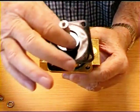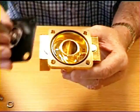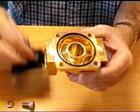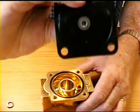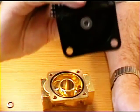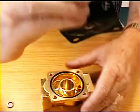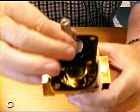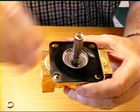So if this seal is over the top and it's pressed down lightly it can't open, and what happens is that the media will actually come through a very very small hole in the diaphragm. It's important that that hole is not blocked up by anything, and the pressure applied through that tiny hole holds this diaphragm down tightly onto its seat so that nothing can pass through it.